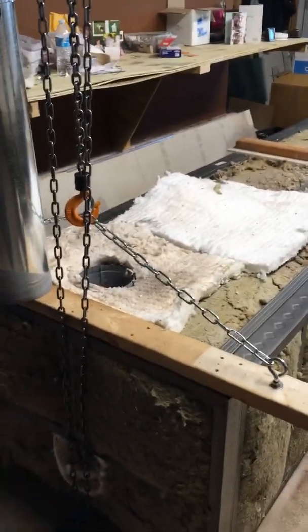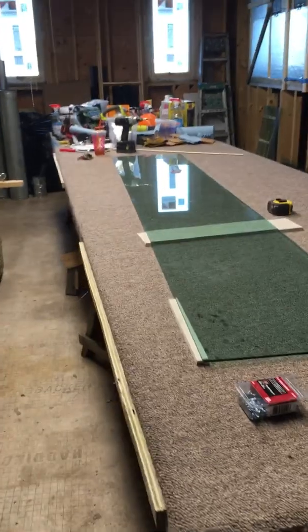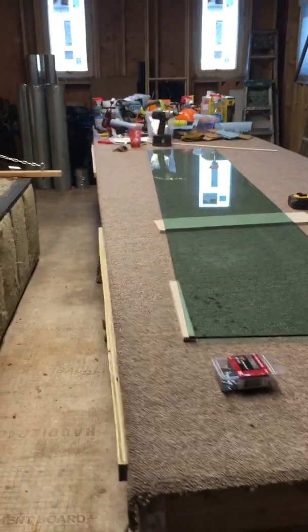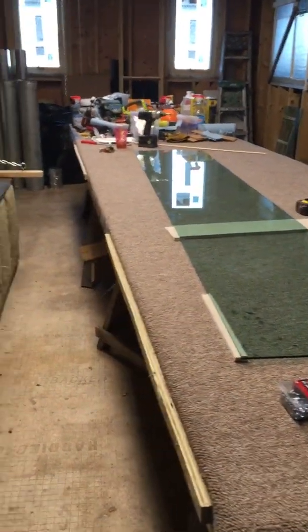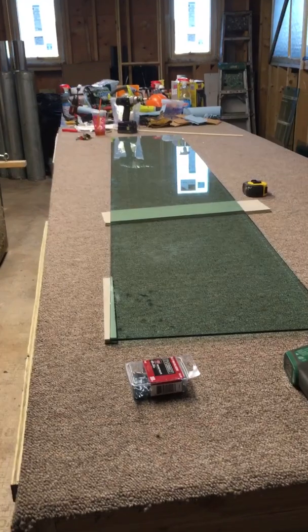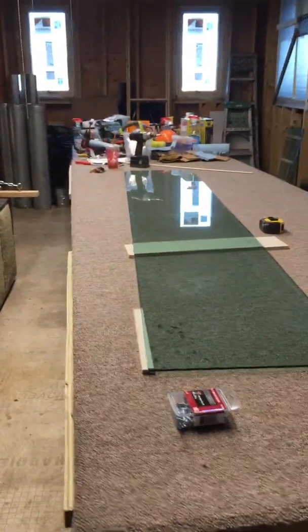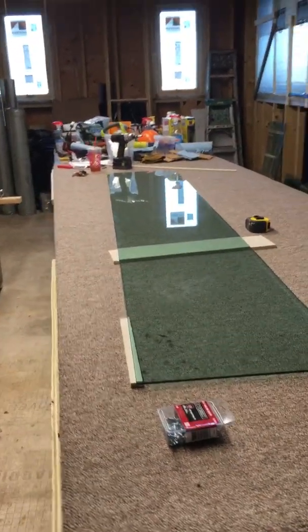Now what we had to do is, since we've got to get this glass up to a specific temperature, and it's in its temperature range, it can't be too cool. It can't be too hot because you're getting distortion. Some of our runs we got distortion. We were too hot in certain areas of the oven, and then it did anneal. And then when we tried not to go so hot, we didn't anneal it.